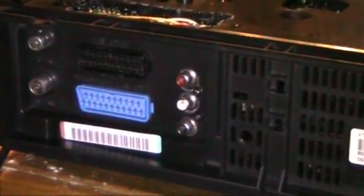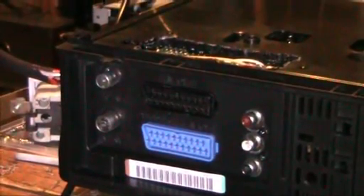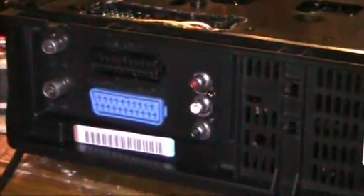Now the problem was, in my original wiring, I had it all hooked up to the wrong jack. I had the three jacks hooked up to the blue jack, but that is the SCART input, so obviously that didn't work. The black jack is the actual output, and this is of course supposed to be a composite video output, so it had to be rewired.